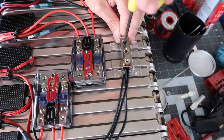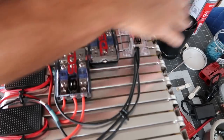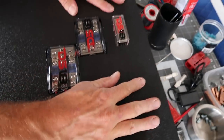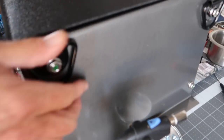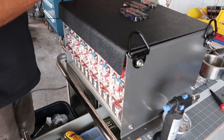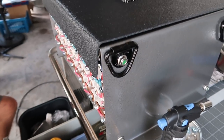We'll clean this up later — I'm just showing for practical purposes. The lid that we made will go right over the top. These are the handles so we can carry it — we can run a strap from here to here, here to here, or here to here. Each one of these hooks is capable of 1,000 pounds, and this battery weighs right at 102 pounds. Of course, there is no time like two days before a charter to completely redo your battery system.